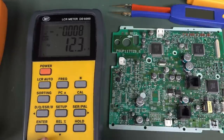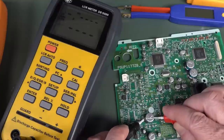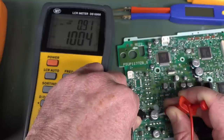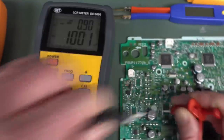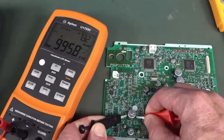Let's try another popular LCR meter — the DE5000, the IET one. You can get these for about 100 bucks — pretty good bang per buck. In auto mode it comes a gutzer, but if you put it on manual range, it reads pretty close to 1,000 microfarads. ESR reads 0.91 ohms — not too far off the other meter. We did have to manually range it though.